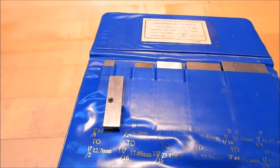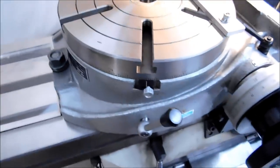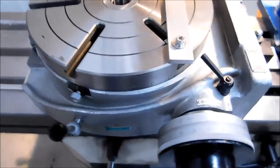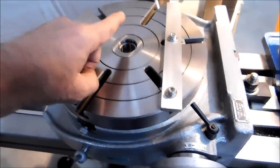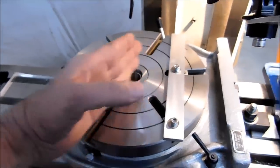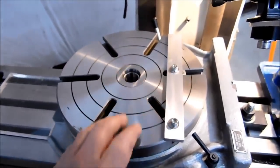Okay, let's relocate over to the turntable. Take a look. All right, once everything is zeroed out, once your dials are zero, your indicators are zero, I mean your rotational indicators, not your dial indicators. But once your dials are all zeroed out and you establish an axial concentricity between your part and the machine, well, the radial alignment is going to be your next obstacle.